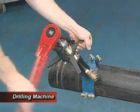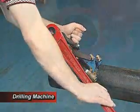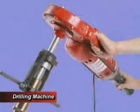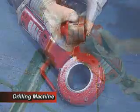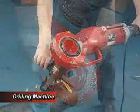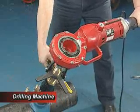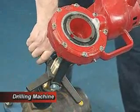This concludes the DM1100 and DM2100 drilling procedure. As with tapping, add power to your drilling projects by using a Reed power drive adapter and the 700PD power drive. Insert the adapter into the power drive and attach the unit to the top of the boring bar. The operator manually turns the star feed while the power drive turns the boring bar, allowing the operator to control the feed rate for drilling.